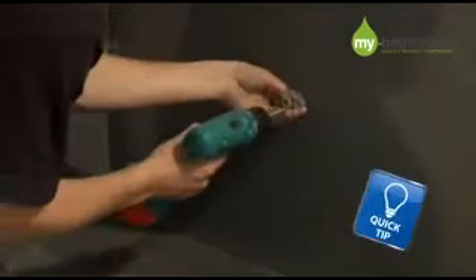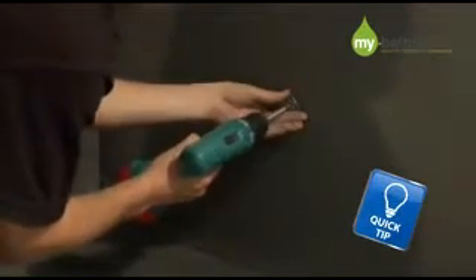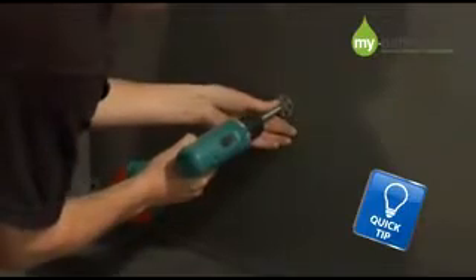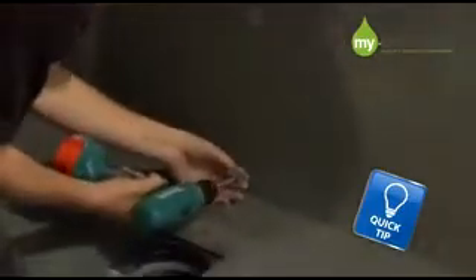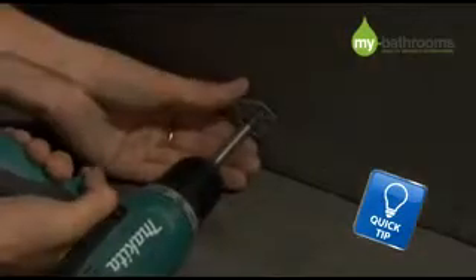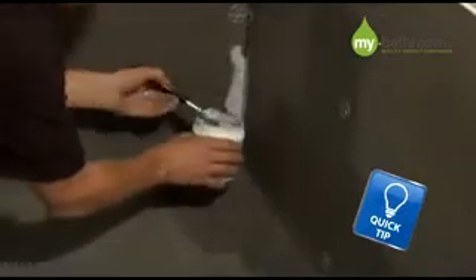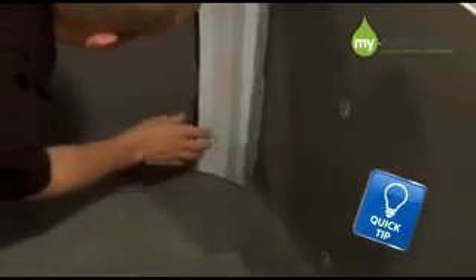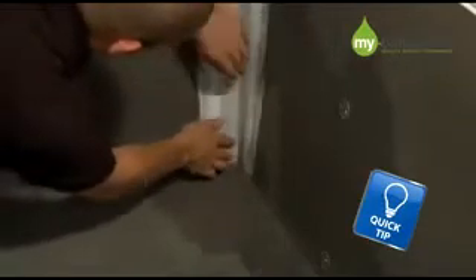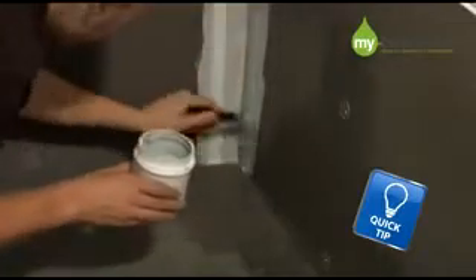Although in this wet floor installation you see the walls aligned in plasterboard, which is common in the UK building industry, we would highly recommend the use of our 12mm waterproof wall panelling, due to its many advantages over plasterboard. It not only gives a waterproof substrate for tiling onto, but it also gives an increased insulation value in the room, a far stronger adhesive grip to tiles and has anti-mould properties.